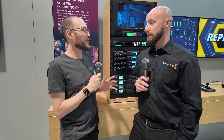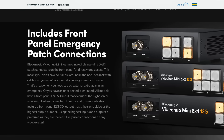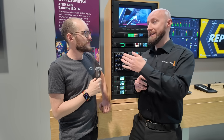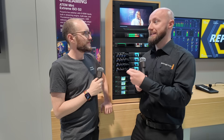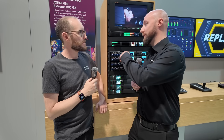As you progress up the scale, you'll see them in racks and flight cases. The most standout feature is the emergency input on the front. You can walk up with any SDI device, plug it into the front of the router, and that's going to override your last input — always the last one. The idea is you'd probably put the least essential sources toward the end. So if you're in a production and someone needs to get a feed into the ecosystem quickly, you can run up, plug it in, and you've got that available on your last input straight away.